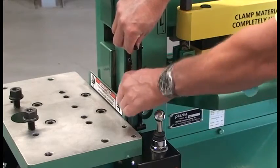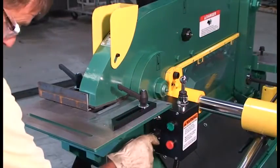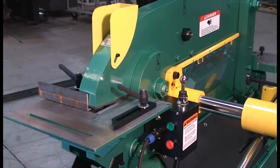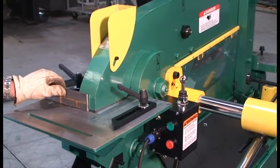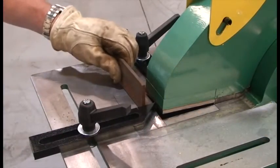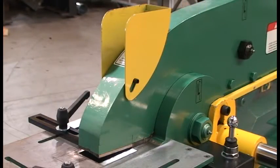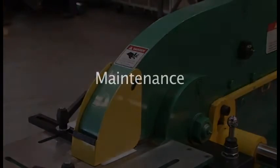There is no limit switch for the downstroke of the Coper station. Plug in the foot control and flip the foot control toggle switch to the on position. The notching process can now be controlled using the foot control for hands-free operation. Use the adjustable Coper table guides to provide repeated notching and coping. Always return the safety guard to the down position when work is completed.